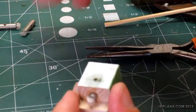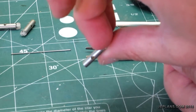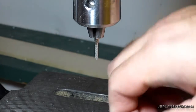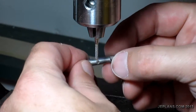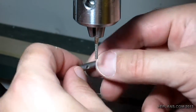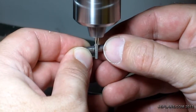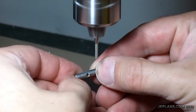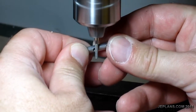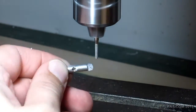Once you're done drilling it out, you unpin it and force it out. Of course it will be hot — this one had a chance to cool. Now we have to clean up the edges. A small diamond bit like this I've found works best to clean up the edges of the hole in the piston. You've got to be very careful — you don't want to grind over to the sides too much or you'll have bleed-through when the engine is operating. Just make sure it doesn't catch. And do the other side — just want to get the edges.